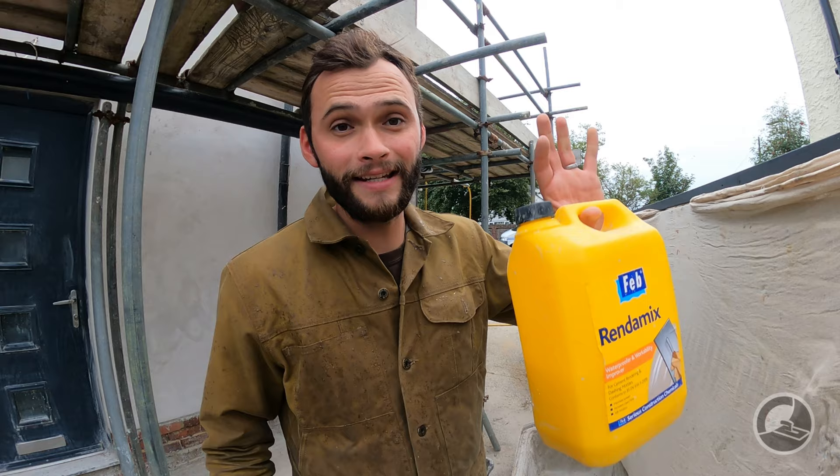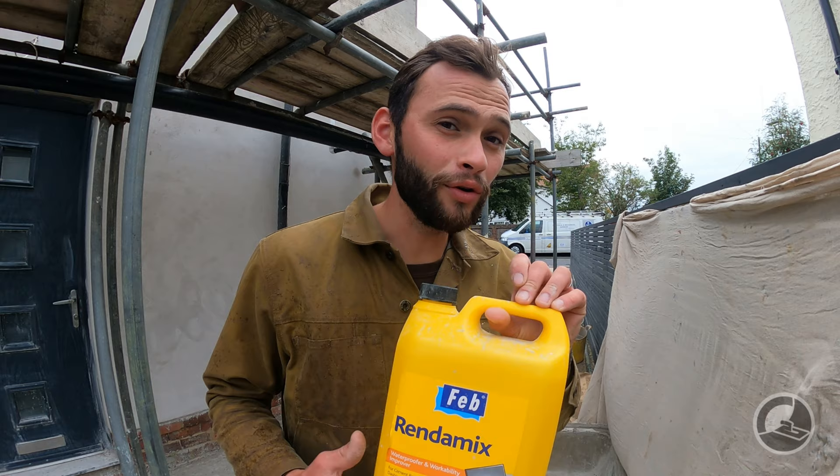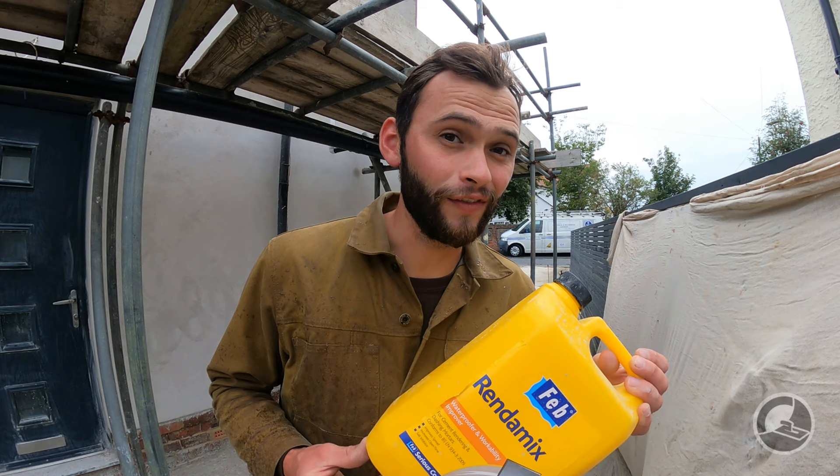For the top coat we're going to use five buckets of sand to one bucket of cement — or because we do double gauges, an entire bag of cement in one go. We're not going to put SBR in, and we're not going to put Feb Proof in. Instead, we're going to use a product that Blaine Gray has mentioned many times: Render Mix. This is essentially a waterproofer and plasticizer. We would not recommend using it as a waterproofer for your scratch coat — it just isn't that great for that purpose.